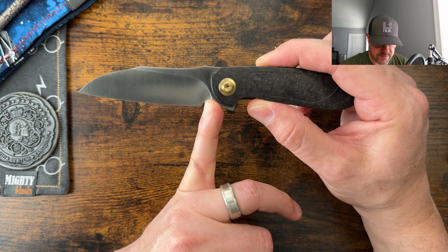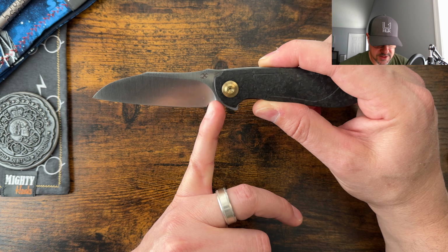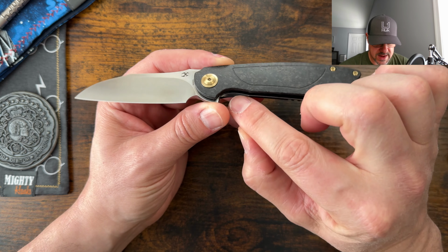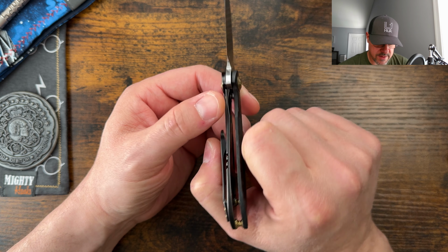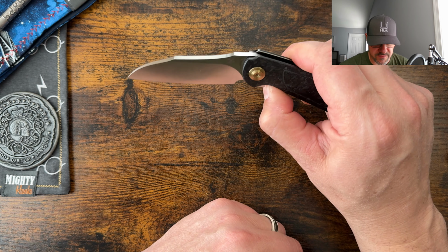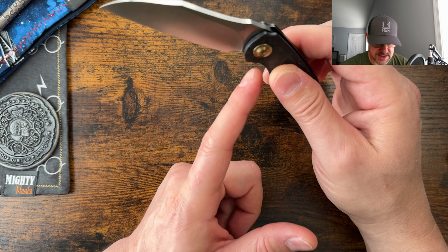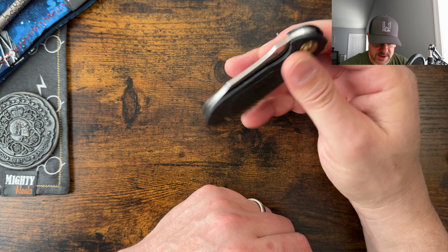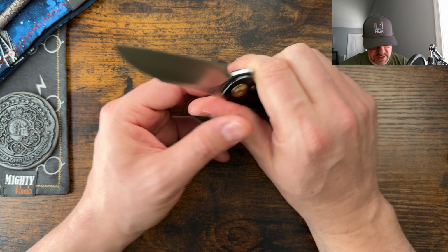The plunge grind finishes pretty much back here, just the way that this is designed. It's a little bit further back, but you're going to get plenty of sharpening life out of that. You got nice access to the lock bar. The lock bar lockup is looking at about 30%, maybe 35%. And then with this, like the budget, once you disengage the lock, the flipper tab falls to the back of the thumbnail, and then it's just a matter of giving it a few shakes home. I really do like this one.